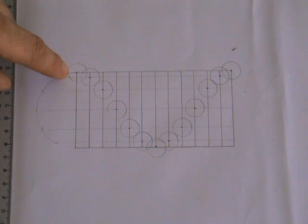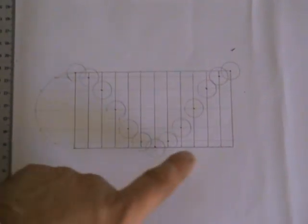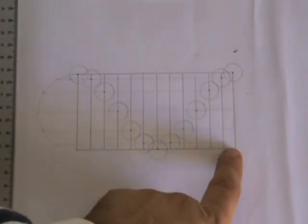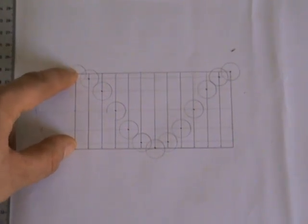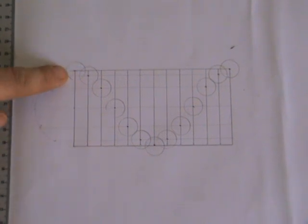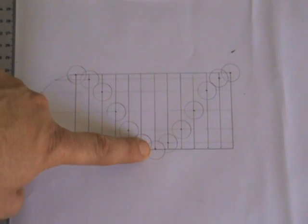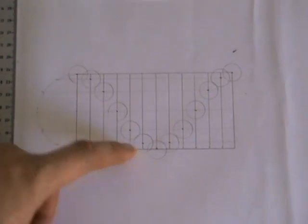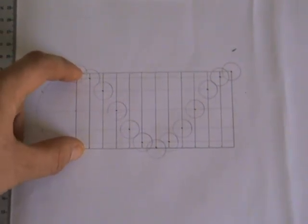Here you have the completed helix. The pitch goes from this point to that point. This point here is not the outer diameter nor the inner diameter of the helix — it is the diameter measured from the center of the circle to the other center of the circle. So the helix is going to extend outside the diameter I've drawn to construct it.